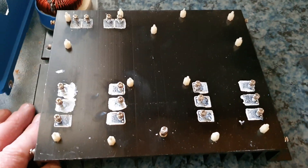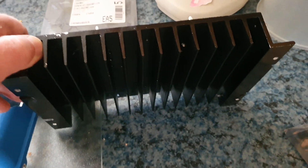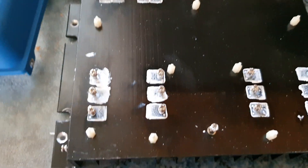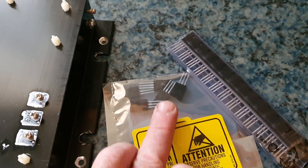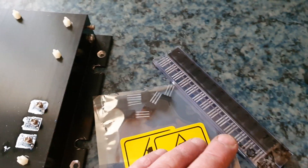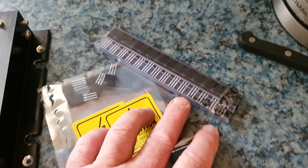With a bit of heat transfer compound on the heat sink, you can actually see how the screws come through from one side to the other - they are drilled and tapped to hold the MOSFETs. That's the new set of MOSFETs: the 4 that I'm going to replace, I've bought 5 just in case; and for the 12 to be done, I've bought 14 as spares.